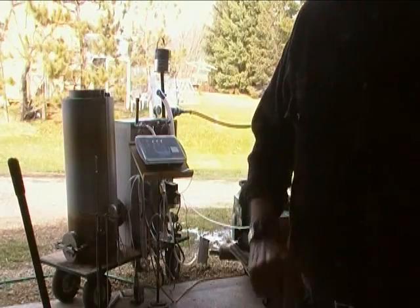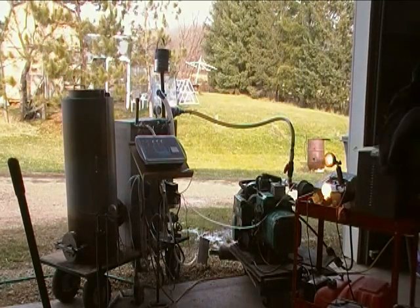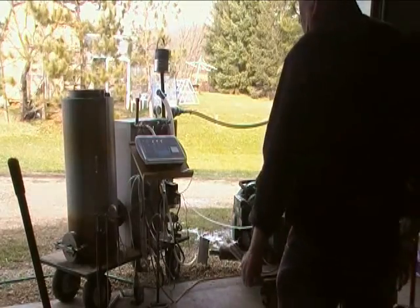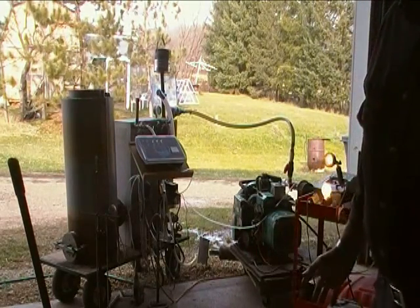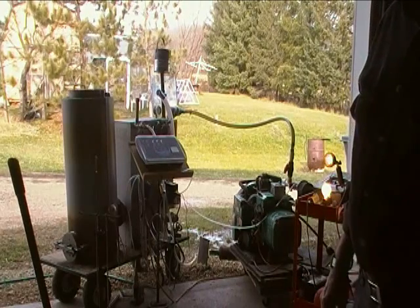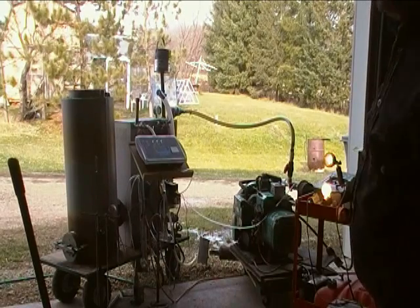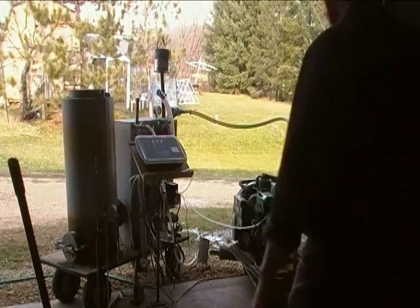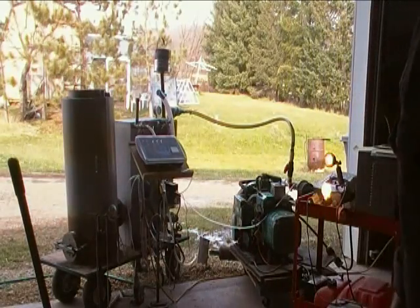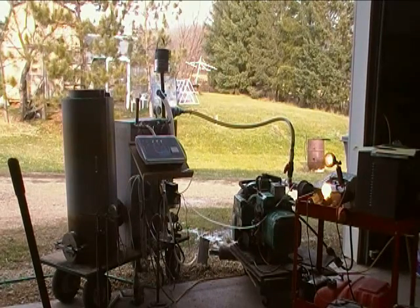It's 1:45, and at 1:36 I added the load. Today the blower is still on. I made the assumption from my last run that having the blower off would be better, but I forgot to turn it off and things seem to be going well, so right now I'm not going to mess with success. I have 1,208 degrees above the grate and just about 600 below the grate.